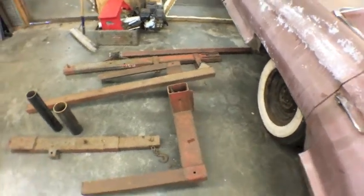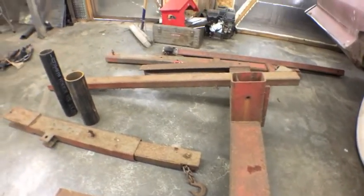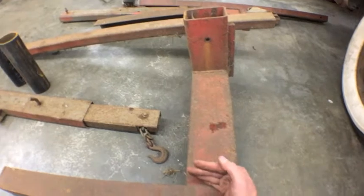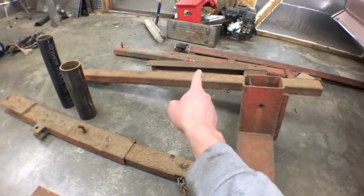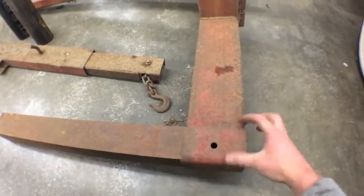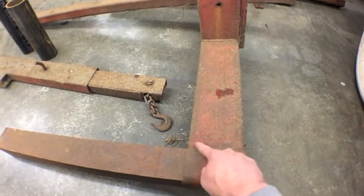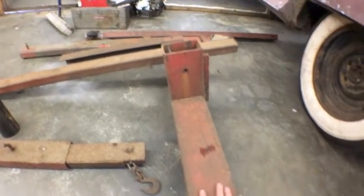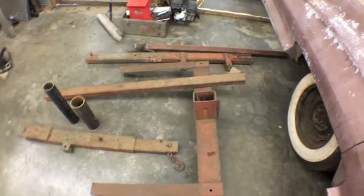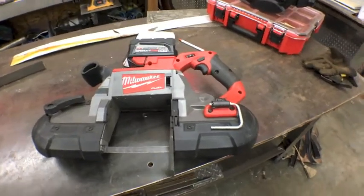The plan — or really my first thought — is I'm going to cut the extra steel off this old engine hoist and then cut it at an angle here, because I want a little more support. This car is wide and I want the legs with the wheels to come in at the back and angle a little bit. So this perch or holder is hollow in the back — I want to re-weld it at an angle. I'm going to cut these off, clean up, and then re-weld these perches back at an angle so I can have a little more triangulation to help support the car. That'll be the first step. A lot of my cutting I'll probably do with my port-a-band — I'll probably end up doing a video on those as well. That one's cordless.